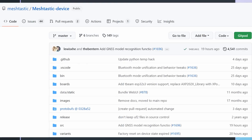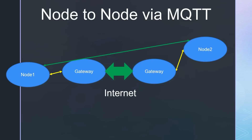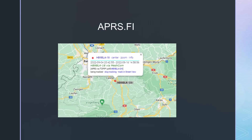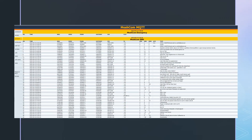We also see that the project is still under heavy construction and more for experimenting than for an emergency situation. One example was that I had to downgrade the iOS app to be compatible with the current Meshcom firmware. I also could not transmit direct messages via the MQTT server to other meshes. But I saw my trackers in APRS.fi — proof that the APRS gateway works. And I was able to send messages to all. If you send a message to all, you can see it in the Activities tab in the backend.